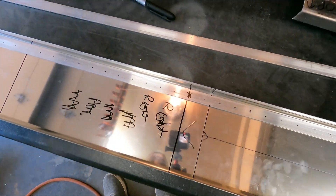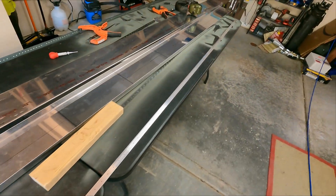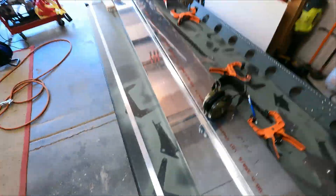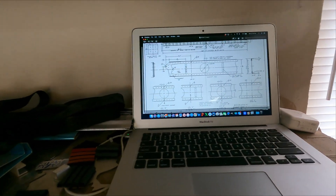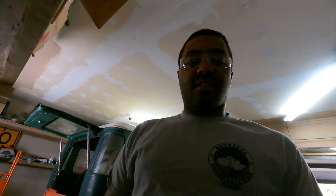We are lined up — rib, rib, rib, rib, rib, rib, rib, rib — lined up there. I'm going to center punch the cap strip and pre-drill with a 3/32-inch drill bit before doing the final drill with a number 21, which is the correct size for an MS-20470-A5 rivet. There are a couple of locations that require 3/16-inch drill bits, but I'll drill everything with the 3/32-inch first and then identify those larger locations.